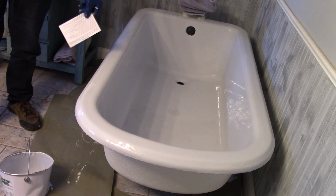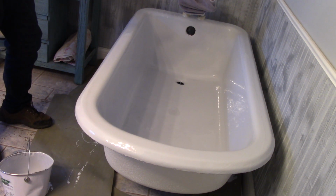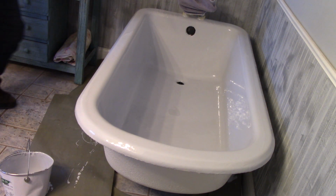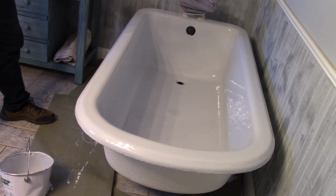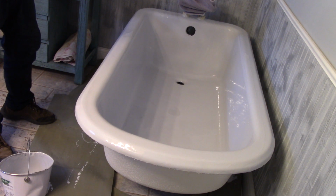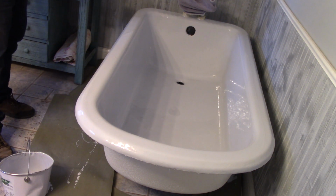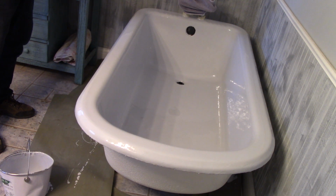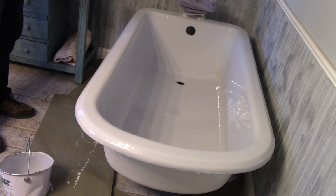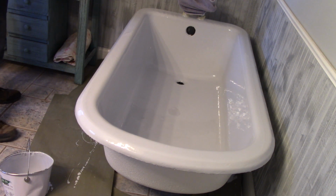Now, we have the instruction card. So, it says pour all scoop material on a front rail, rub roller, blah, blah, blah, did all that. Move material up the tub wall, roll outside tub skirt and any further missed areas, which we did that. Level out and remove excess from bottom of tub. Use a heat gun or hair dryer to pop microfoam bubbles. This prevents staining while it oxidizes. Then you remove any tape. Wait an hour to remove your tape dam, and then hourly scoop off any excess material off the drain floor tape. Wait until material stops moving in the drain area. Remove remaining tape after 4 to 6 hours, and then remove any wet Ekopel with alcohol or acetone. Wait 24 to 36 hours for use.